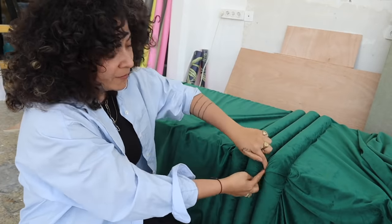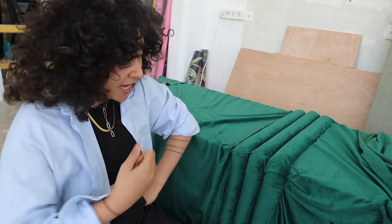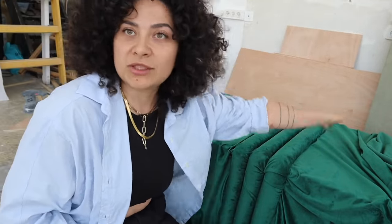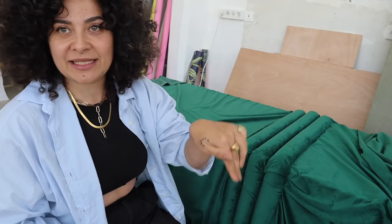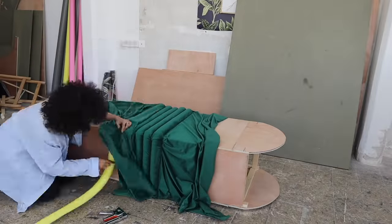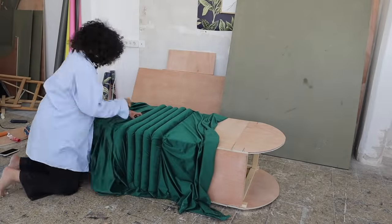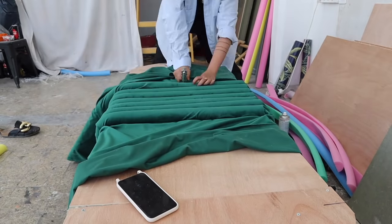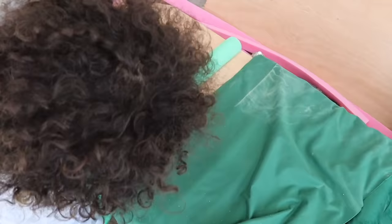Turns out that for the sides, you need to use exactly the same technique that you do for the top. If you put a few of them together at the same time, it's not going to work because the fabric bunches up and you have no space. Put your gun in between — so top, staple it, side, staple it. With the right technique in my head, it was so much easier. You just need to go straight and repeat it and fold it on the side. We're going to do this for all the base, and then you'll see me changing technique once I arrive at the curvy sides of the couch.